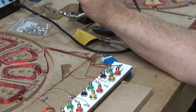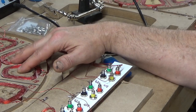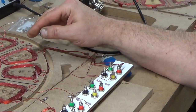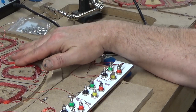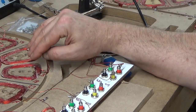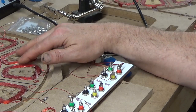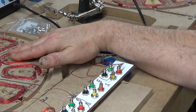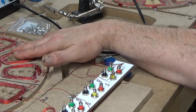Each of these coil sets. One of the tests I'm going to do, and probably the final configuration, is forward biasing by using a diode. A diode to place between the two coil sets. That diode will only be effective when the DC pulse is applied. That way the push-pull is not bucked in any way from the DC current.